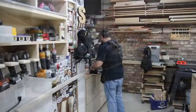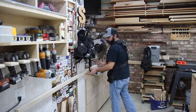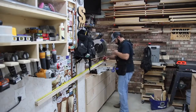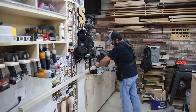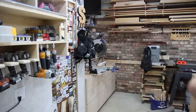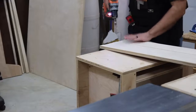With this particular style I'm making the four outside pieces — the two ends and the two sides — but there's also going to be some internal parts. I've already cut down on the table saw a bunch of strips of plywood and I'm just cutting them to length here. This is going to create an internal section of the bed underneath for support, kind of like where the slats are going to go, but they'll all be installed beforehand.